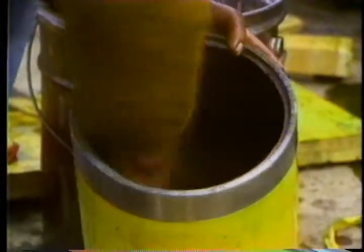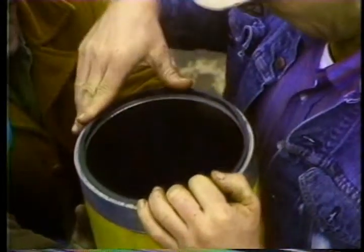Once you have a clean liner with no paint at the ends, install the liner gasket in its groove in the liner — don't grease or oil this gasket. Now slide the liner into the liner adapter on the pump. Grease the exposed part of the liner, the threads of the liner adapter, and inside the liner nut. Take the set screws out of the nut and screw the nut onto the liner adapter. Tighten the nut with a bar and sledgehammer. Feel inside the liner to make sure the gasket is seated properly. Put the set screws loosely back into the liner nut.